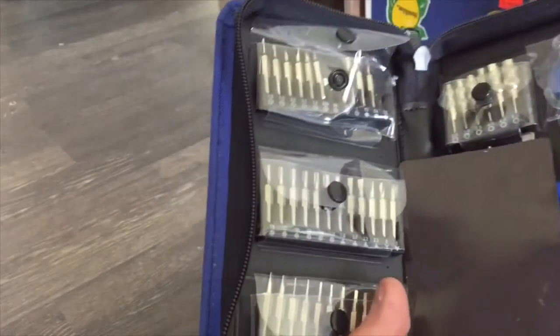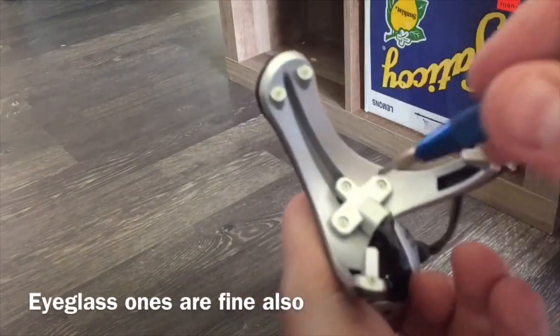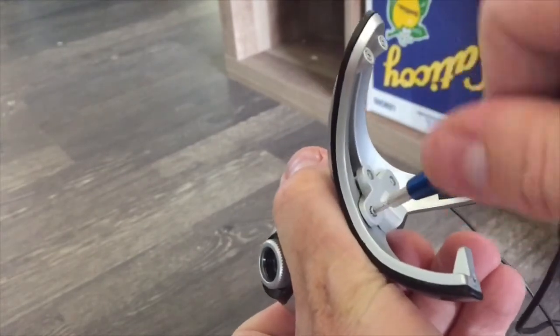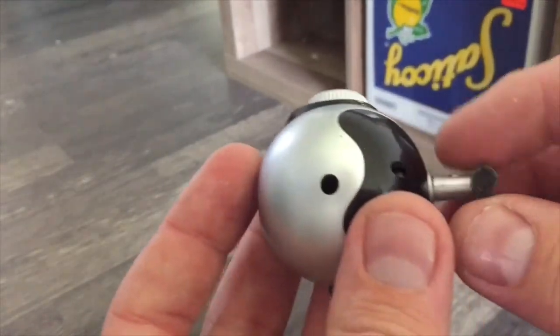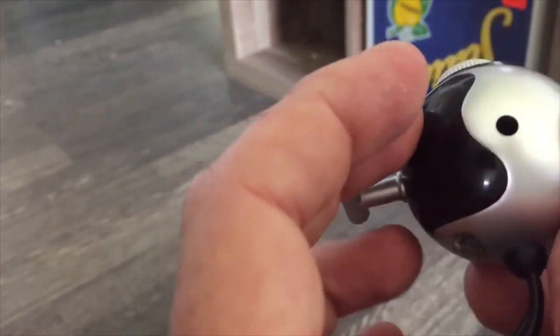So let's briefly go over modifying the camera itself. A set of technician screwdrivers will help you along the way. It's really simple. Basically, get rid of whatever mounting equipment there is. It's just dead weight. It's going to be in your way. And typically, there's 2 to 4 mounting screws. Sometimes a long screwdriver will be necessary to get in there. In most cases, they're Phillips head.